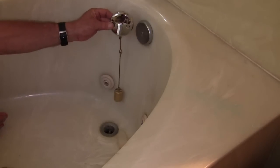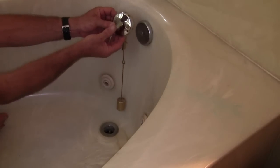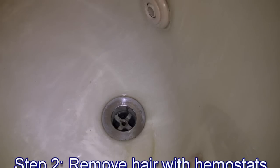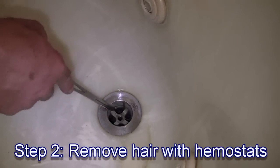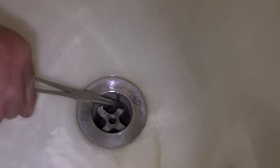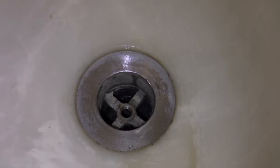For the trip lever tub waste, if you want to clean out that drain, make sure it's in the drain position — lever down first. Then pull the hair that builds up on the cross pieces off with a pair of hemostats. You can use a sharp knife to cut it if you have to, but don't let it go down the drain — just reach down there and grab it all out. There could be a considerable amount.